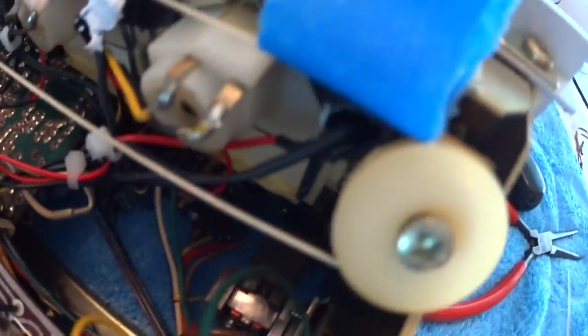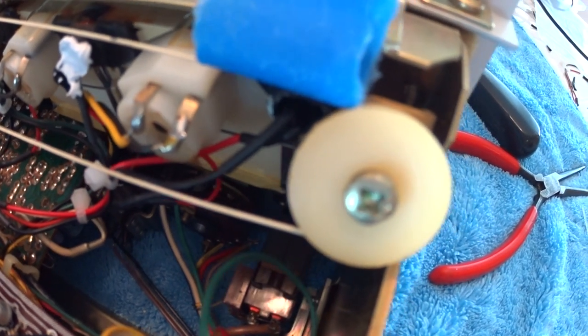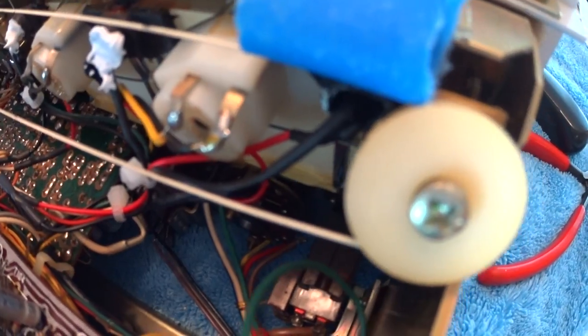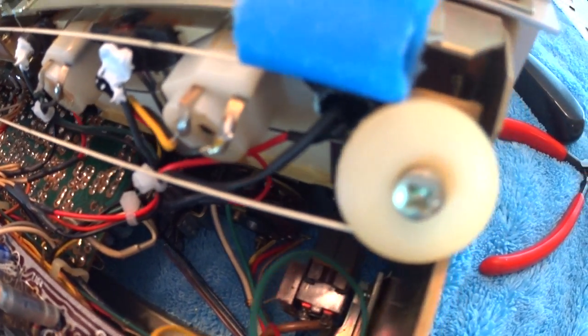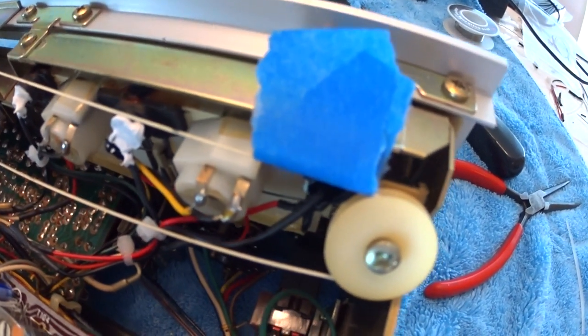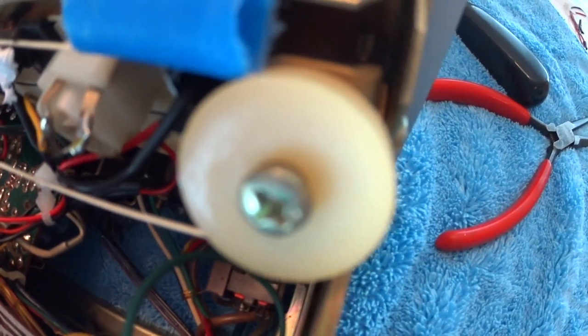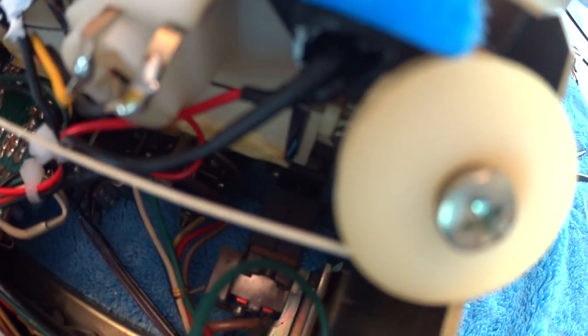You can see I put just a little white caulking on the LED bulb housings so they can't pop out. Make sure it's clear of the tuning cord. This spot is very tight, so I'm using a small pick to apply the caulking. Do not get caulking on the tuning cord - it's a nylon cord with threads, it'll absorb into it, make that part stiff, and it won't be flexible anymore. I took a little piece of painter's tape and taped it in the air on both sides to protect the cord without actually taping onto it.